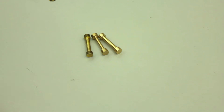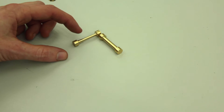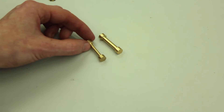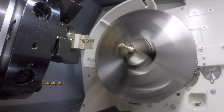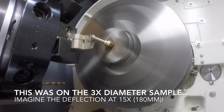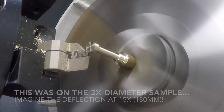Here we have three tensile test specimens. We've got one of the original ones purchased from our supplier Tinius Olsen, and then we've got two that have been CNC machined. Spot the difference. The offset was a little bit wrong on the tool; however, what should be clear is that there's a massive taper. That's basically because when this was hanging so far out of the chuck, when the tool came in to cut it, it would essentially deflect towards the end.